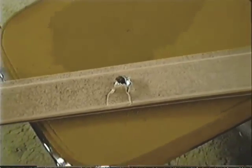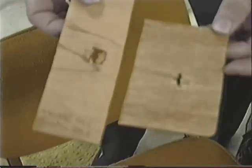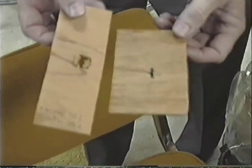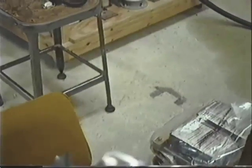You can see that the water — as a matter of fact, at even lower energy than that — this is what happens. That was 256 joules, that's quarter-inch thick birch plywood. You can see it cuts a hole right through it. That's just water — there's no chemicals, no explosion or anything. And it drove the aluminum right up through this. See, it just went right straight through it.